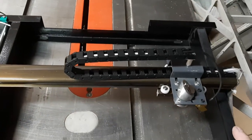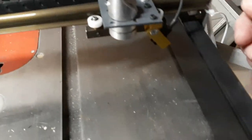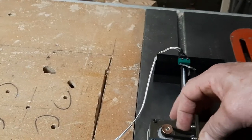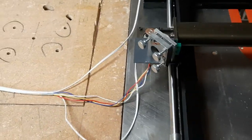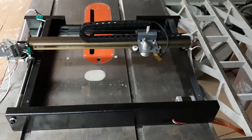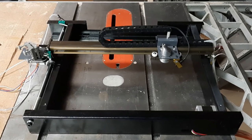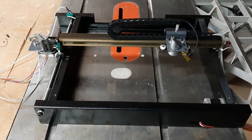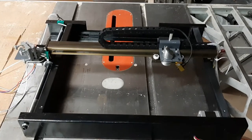These are not a normal belt spec, so be careful if you need to replace a belt. The pulleys that drive them are also not a normal belt spec, like you see guys using for motorized X or Z platforms. Your tensioners for the Y belt are on the back — they are number 10 metric. The tensioner for your X is in here and you're basically not going to be messing with it a whole bunch. If you have any questions, drop me a line. I hope this has helped somebody visualize what their system looks like inside, because this is where all the work is going to get done. The better understanding you have of the way the parts interact and where to go if you have a problem, the clearer it will be for you to work the problem out.